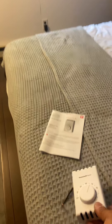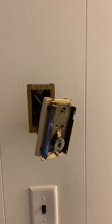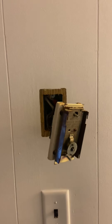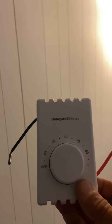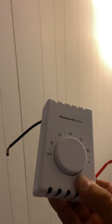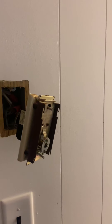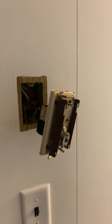With the two-pole, it actually cuts both lines of power to the radiator. I'm mentioning this because some people think they've shut off their thermostat, but they're not really shutting it off if it's a single pole connection. Then they get the electric bill and say, 'Why am I wasting electricity on my vacation home when I have everything off?' Usually when you have a single-pole thermostat it doesn't say 'off' — it just shows the lowest setting. This one has an 'off' label because it's made for both single and double, but if you wire it single, you're not really shutting it off completely — it's just the minimum setting and will trigger if it goes below 40 degrees.